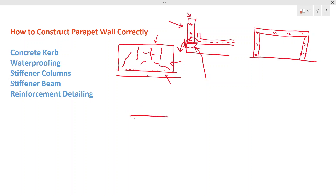You cannot simply construct the parapet wall directly on the concrete slab. The correct practice is to cast a concrete curb on the slab first. This curb means water filled by rain cannot leak at that joint because you have solid concrete there rather than a brick-concrete interface. This protects the brick wall from dampness, which would otherwise damage your paint finishes. You can then do the waterproofing correctly and build the brick or block wall on top.